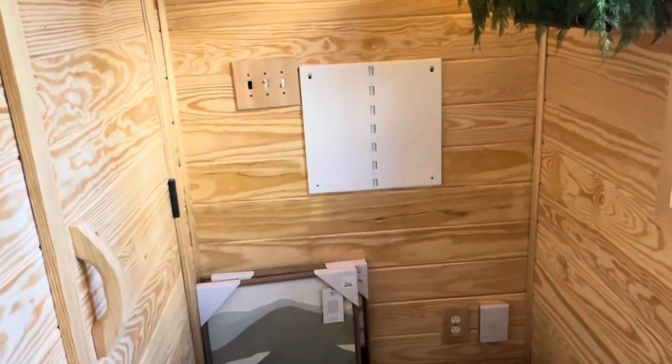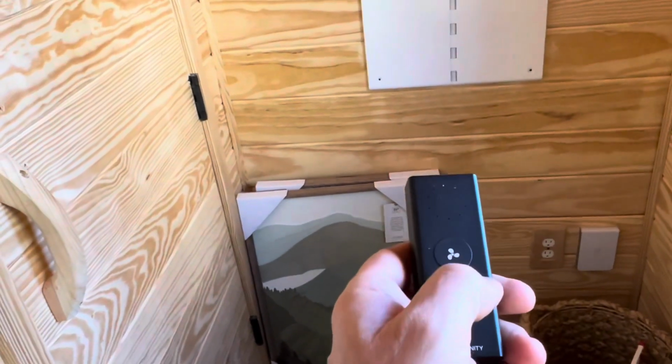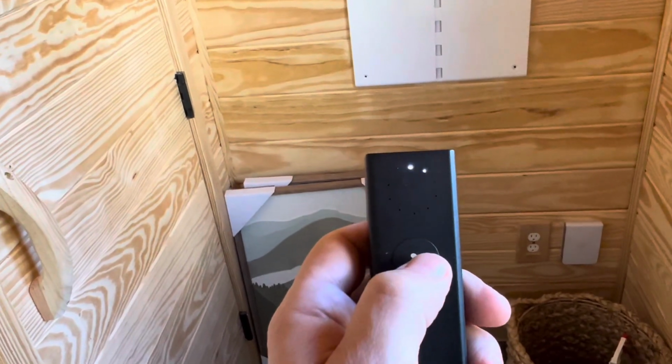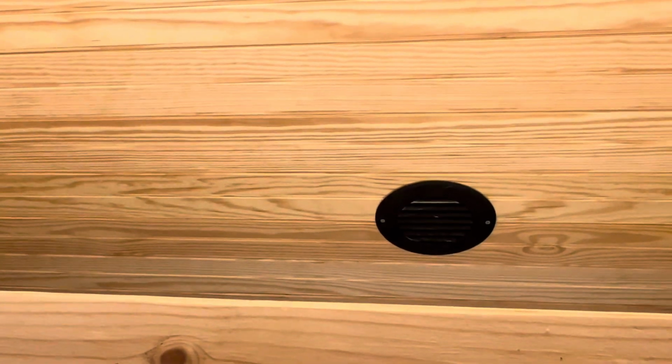All right, so finally, when I have everything heated up, just use this little remote control here and turn it on, and you can see for a 6-inch fan, you only need probably 1 or 2, maybe 3 if it's colder outside. And let's go in and hear how it sounds. All right. So you can hear it firing up. It's actually very quiet. Again, that's for a 6-inch fan at number 2 setting.